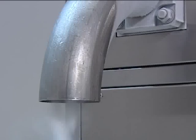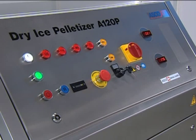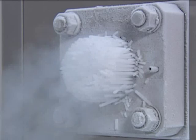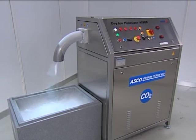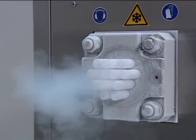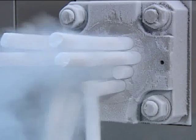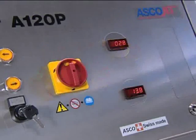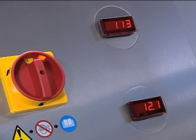The A120P Dry Ice Pelletizer is a compact and versatile dry ice production machine with a push button start, driven by a powerful hydraulic unit. It supplies high quality dry ice pellets in five different sizes for blasting and cooling purposes. With a production capacity of 120 kilograms per hour, it's perfect for medium to large dry ice users. All functions are controlled by an integrated PLC, and the control panel ensures an easy overview of all important conditions.